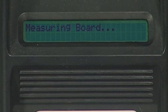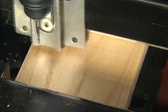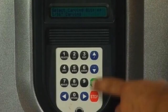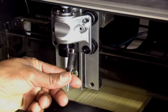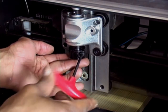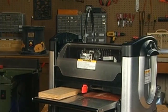Again, remember: if you choose the Stay Under Rollers option, you must have an additional 7 inches of length on your workpiece or you cannot complete the project at full size. Using the Measure function of the machine will provide the most accurate measurement. Once all of the required data has been entered, the machine will prompt you to insert the required bit, telling you which bit to load based on your project design. Pressing Enter will move the cutting truck to a position in the middle of the machine for easy access to load or change the bit. For projects requiring more than one bit, the machine will prompt for each bit and will store the calibration settings.